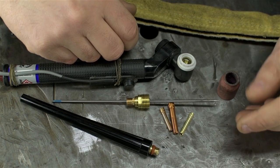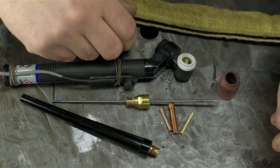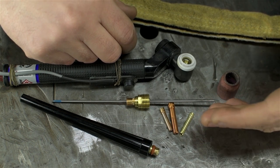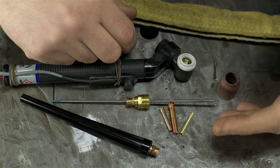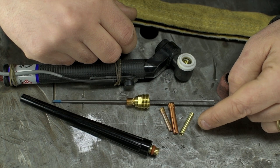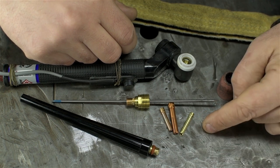It's a coincidence I happen to not crash the electrode as often as I used to, so the new collets seem better. Or I've been using the old collets long past their expiration date, should have been swapping them out more often. Whatever the case, I think I'm going to stick to buying these wedge-style collets. I just wish I would have gotten turned onto them sooner.